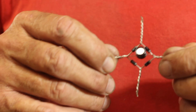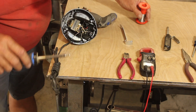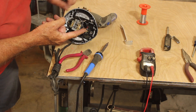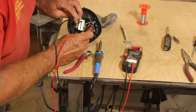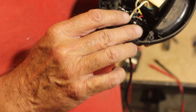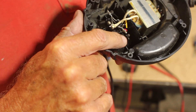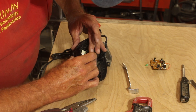Now we'll solder that up and make sure we've got the polarity of everything right. With that circuit board gone we've got plenty of space for this tiny little circuit to fit just right inside the case. And if anyone's interested, here's the circuit diagram — it's the most basic power supply you can have. Now if we plug that in we should get plus there and minus there. There we are at 16 volts. I think once we put the load on it it'll probably drop. There's nothing wrong with having it hang in mid-air like this since there's no stress on it, but you see these springs underneath present a possibility of a short circuit. So I'm going to put some double stick tape over those and stick this down onto it — this foam mounting tape is pretty good.